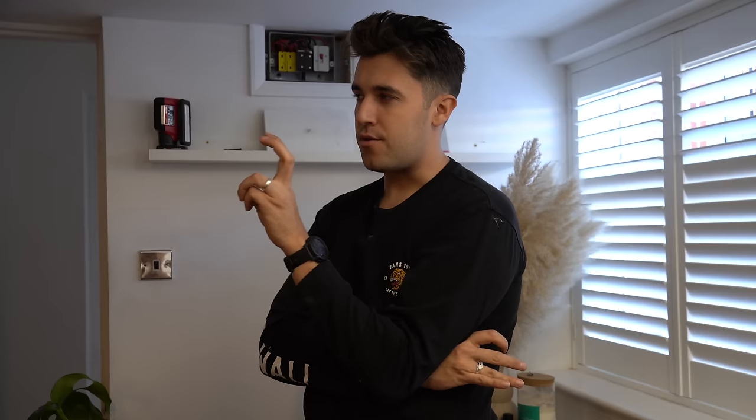Not all of it's deadly, and if it's deadly then obviously I've put it right within two to three business days. But when it's like the C3 issues — I'd say, we've got a lighting circuit with 4mm cable in the loft — I'm like, it's not really right but I'll do something about that soon. What I'm thinking is, while we're here today with all of this going on, let's just put all of these things right. It'd also be quite exciting to show you some of the bodgery in here, so you can see that I'm just a humongous hypocrite — all these times I've come to you saying this is deadly, something should be done right now, and then I've got my lovely family sleeping in a house with that kind of workmanship going on. I think we should take you to the loft.